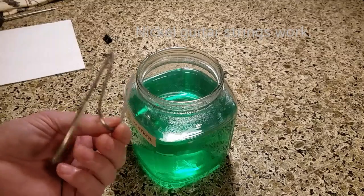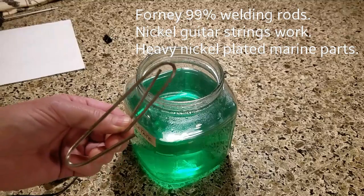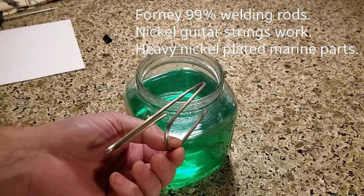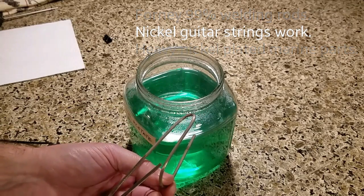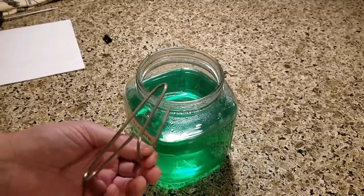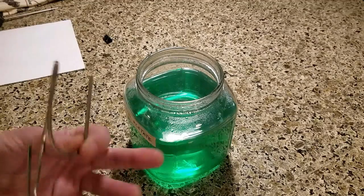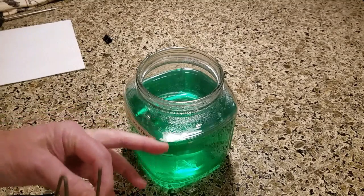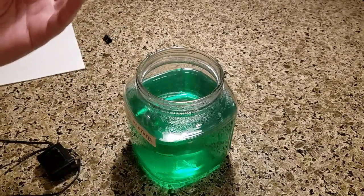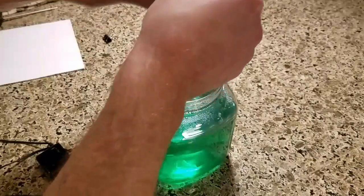Another big popular question: what am I using? There's nickel plating, copper plating, silver, and other types. I've done copper and nickel the most. For nickel, I use welding rods — this is a 99% nickel welding rod with all the flux removed. If your rod doesn't state the nickel content, don't use it — mixed metals will ruin your solution. You can also use a thick nickel-plated piece or even guitar strings. This is just what I use and it works like a champ.